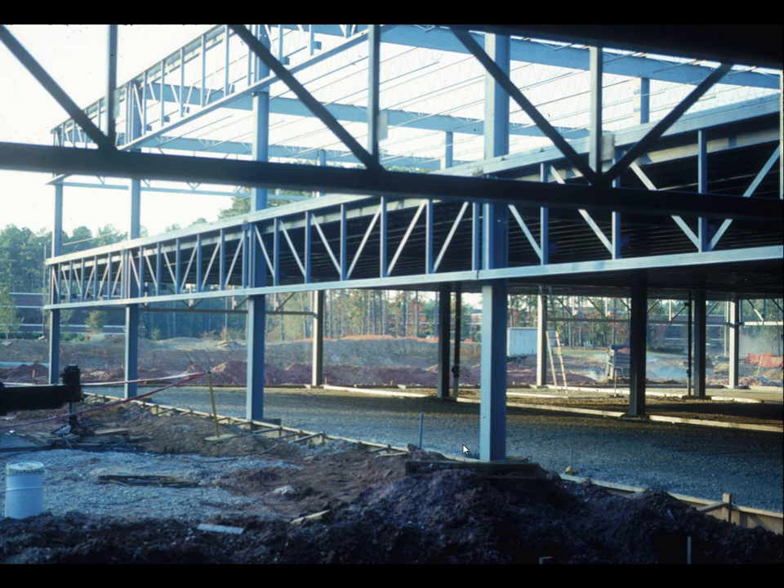Here's an example of a building based on this principle. There are no shear walls, no cross bracing anywhere in this building — just a moment connection between these deep trusses and these vertical columns. You'll notice these columns are fairly stout looking because they are resisting bending influences under wind load and things like that. But they're pretty efficient even then, and they give great architectural flexibility because there doesn't need to be any cross bracing internally. This building takes off on the same principles as the World Trade Center and the Sears Tower, using moment-connected joints — in this case between horizontal trusses and vertical wide-flange sections — to create the stability for the structure.